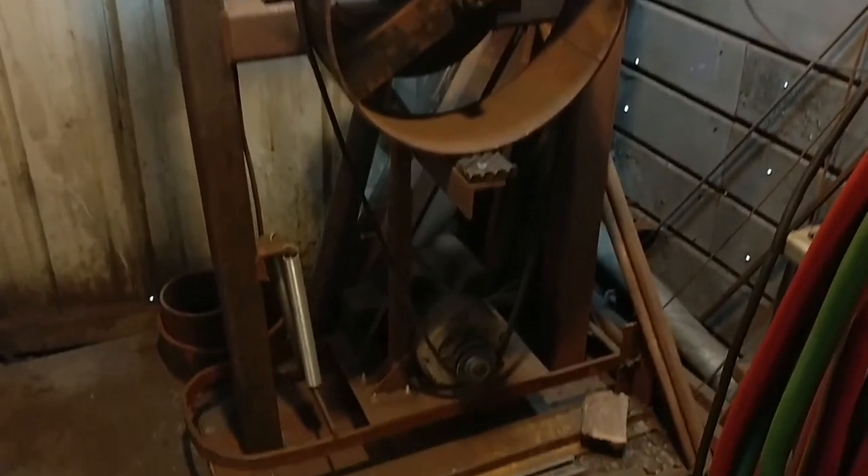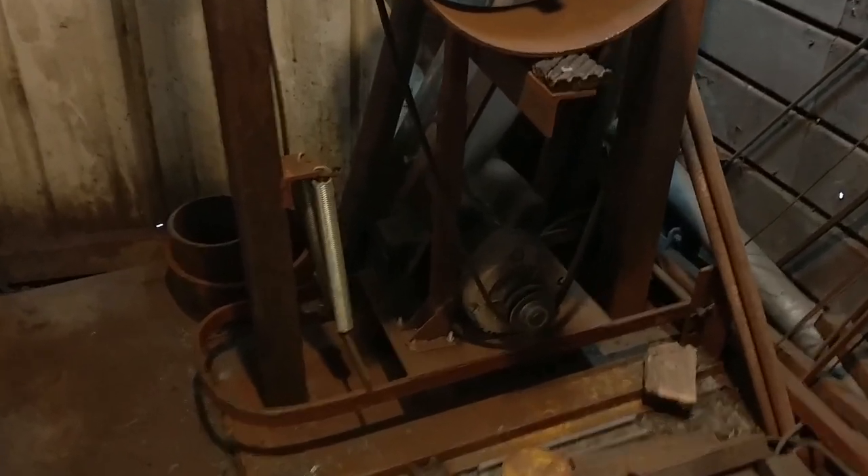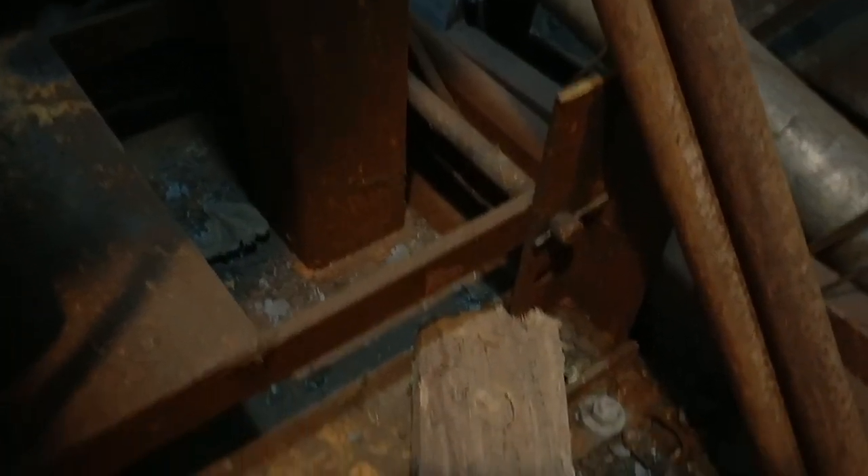So there's the general overview of my power hammer. It's very hard to get in real close to show everything, and that's what I made detailed plans for. Back here is just a simple treadle connection — it actually has multiple holes so I can adjust the height of the treadle if need be. I found that this height works perfectly for me, and the plans will have some adjustment there too, so you can set it to whatever height works best for you.